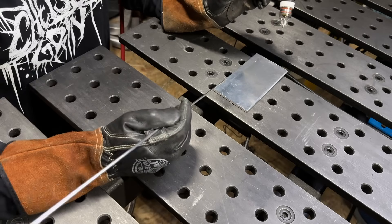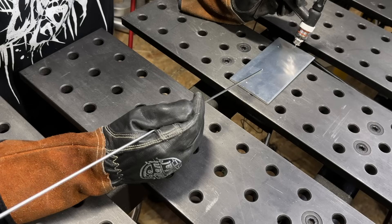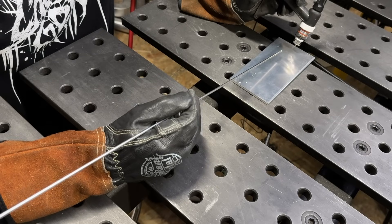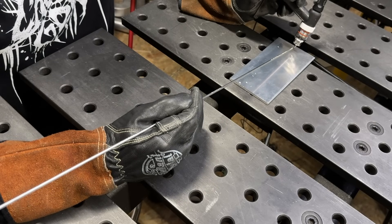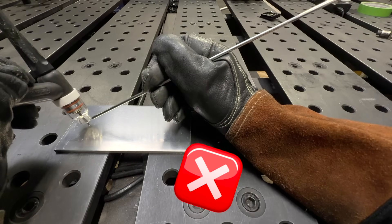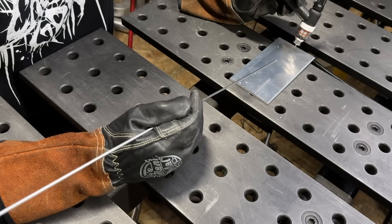Now when your travel hand is all comfy, try this with your filler rod. Position your feeding hand approximately six inches from the end of the welding joint. Start feeding the filler material out from your hand and make sure that you keep your filler hand stationary in this position. Do not creep it towards the welding area. Make sure it stays stationary and feed it all the way out until you've reached the welding area.